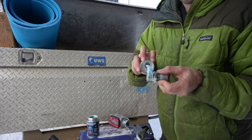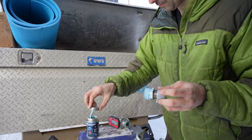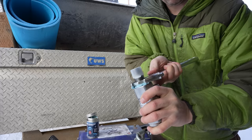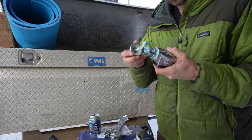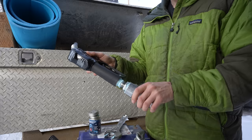Perfect — off to a good start. Now we're going to go ahead and thread this in and use our wrench to crank her down. Way better than a hose clamp. Now let's get some pipe sealant on the other end of the meter and we're going to attach the nozzle to this end. I'll try not to get sealant down into the pipe itself. We'll get that sealant on and then thread the nozzle onto this end.